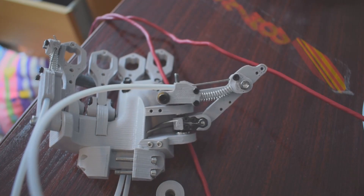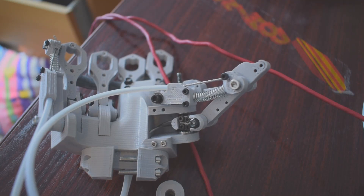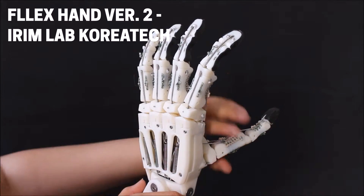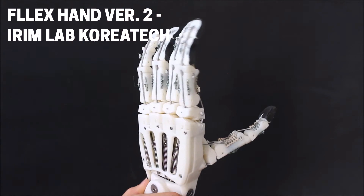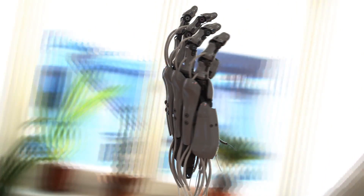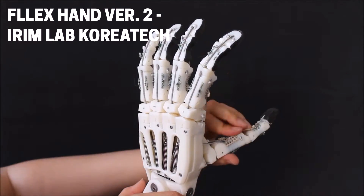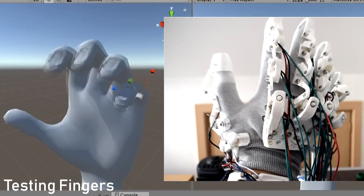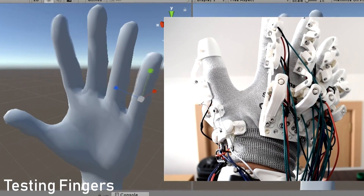So here's how I intend to apply this research to my new design. Compliant actuation is on my mind — that's an actuation system that can be forcefully moved from the motor's equilibrium position without damaging the motors. I want a solid and reliable bionic hand platform to develop a control system on, so I want as few links in the chain of actuation as possible to reduce failure points, and then work on optimizations like compliant actuation later.